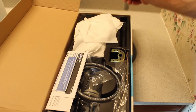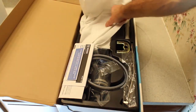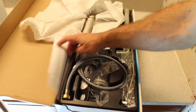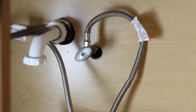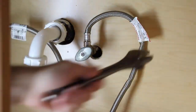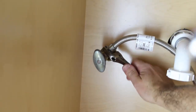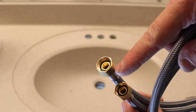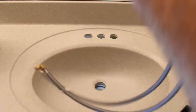Here's the setup. Once you open the box, you get a little tool to help you tighten down the faucet onto the vanity. The faucet comes wrapped, which is nice because you know it's protected and won't be scratched. You also get the steel-braided supply lines. Make sure the shutoff valves are turned to the off position and use a crescent wrench to remove both supply lines from the hot and cold shutoff valves. Steel-braided supply lines are the only supply lines you should be using these days.